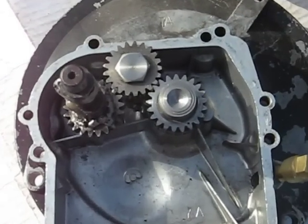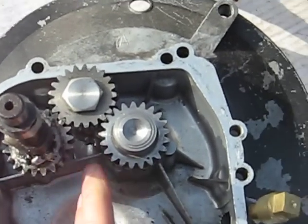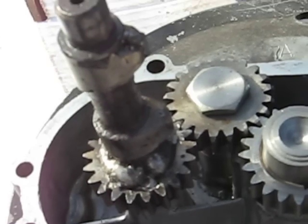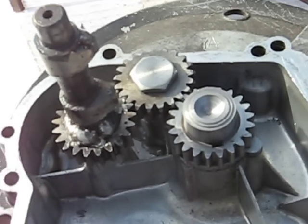This one here is a full-speed camshaft drive. You can drive from the crank here and it turns the camshaft at full crankshaft speed. You can see the camshaft in it has two lobes, so it opens both valves at once.